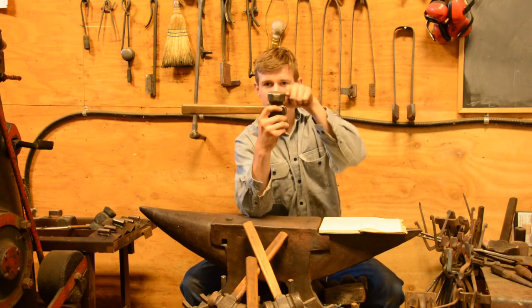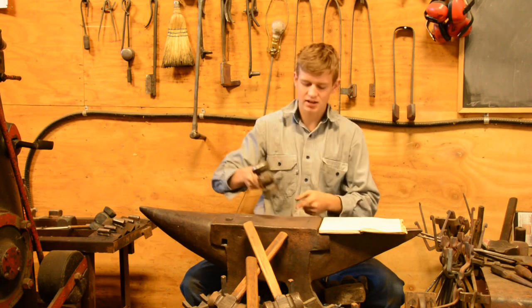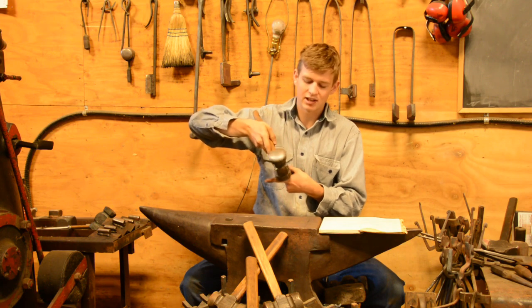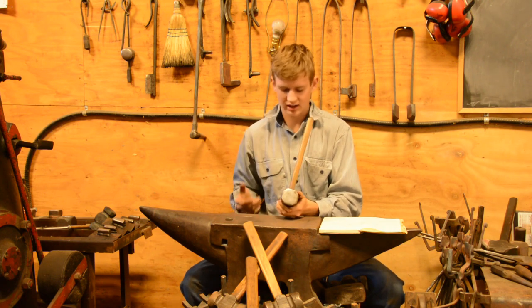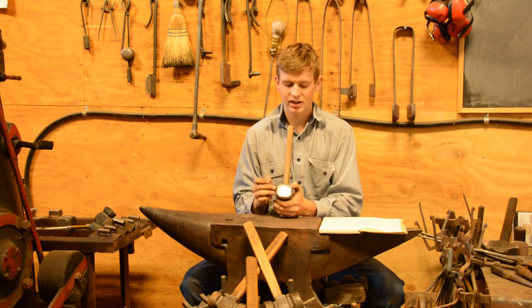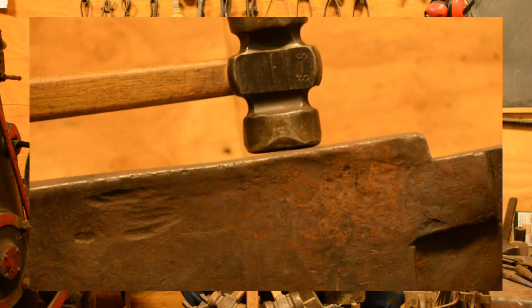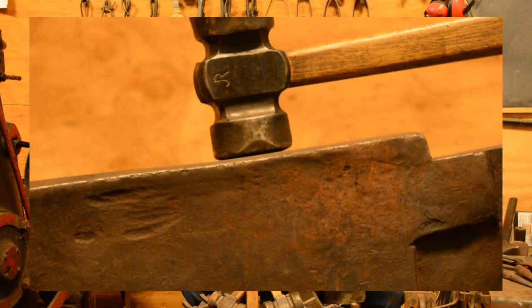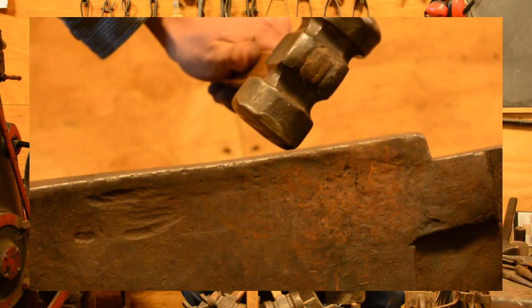You've got a little bit of a radius, of course, back to front, and a little bit more of a radius side to side. And that's because, generally you're forging perpendicular. The hammer handle is perpendicular to the piece, so you have a little bit more give as to the angle that that's going to be at. Whether the hammer is square, like a square circle hammer, or round, they're generally ground with this square grind on it, so 4 sides and then the corners taken off, and that's so you can turn the hammer, you can tilt it with your fingers, and that's going to give you either, depending on the orientation of the hammer, a cross peen or a straight peen, so it can be used as that as well. So very versatile, very good.